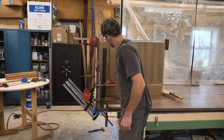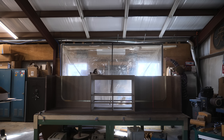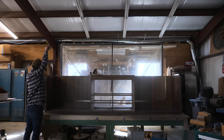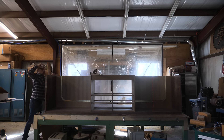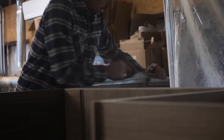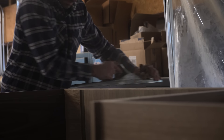Checking it for 90 is really important. I've got a laser level set up and I'm measuring — I built the whole thing upside down because I have this really flat work surface with my veneer table, so I can use that to check that my bottom is all at even height and won't rock. I'm checking every corner of the table bottom and seeing if I have any high spots or low spots. I did find one in the back corner, so I took a hand plane and worked it down until all the measurements are the same on that laser line. Theoretically when I flip it, it should sit really nice and flat.